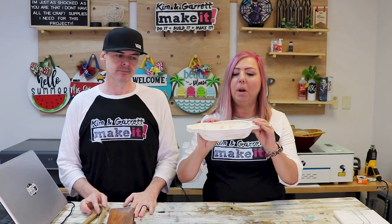Before we start our first project, we'll share a bit more about what it can and can't do. It will engrave concave and convex surfaces. Without the risers it'll do objects up to two inches tall. It likes nice rounded, mellow surfaces below a 45 degree angle. It doesn't like abrupt height changes or really sharp, in-sloping angles — it throws it off.